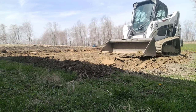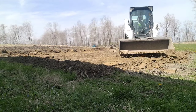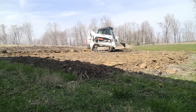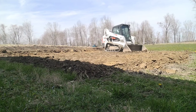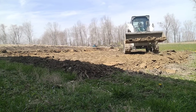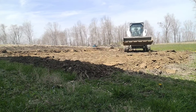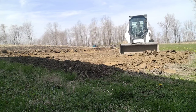There are some bigger rocks in this project. The more that they're broken up, the easier they're going to be to get graded around and the better it's going to work out for you. Work the material out to a little bit wider than what the building is going to be — the structure size — that way it's got nice support around the edges. You can always trim this up once the building's up, but always go a little bit beyond your structure.